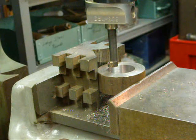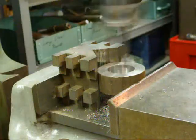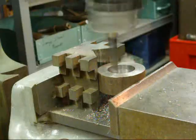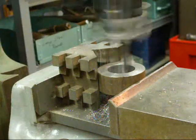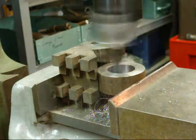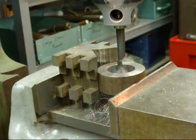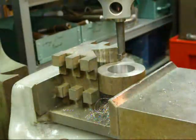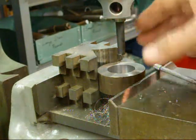This next pass will pretend it's our last pass, so we're going to feed real slow. We're getting a pretty decent cut. When you get down to your final passes, just take off two to three thousandths and keep stopping and checking your dimension so you don't go over. It's easy to take the chips off — it's mighty hard to put them back on. You don't want to spoil your work. Then take another reading with the micrometer and gauge to determine how much to turn in for the final cuts.